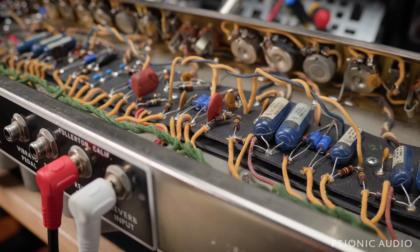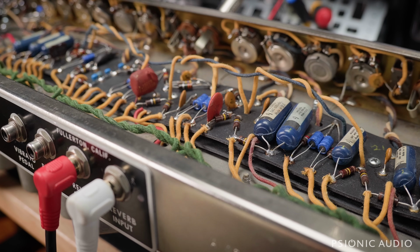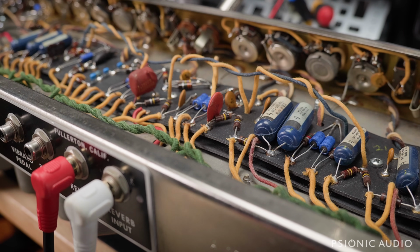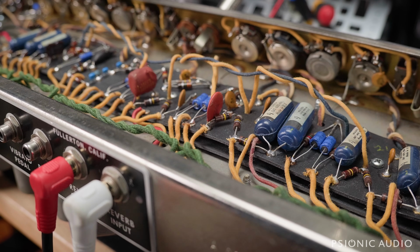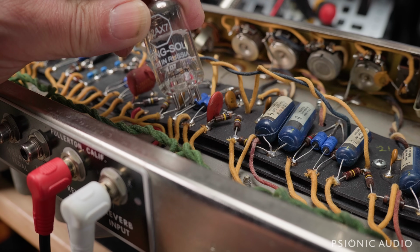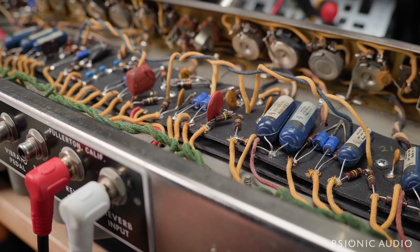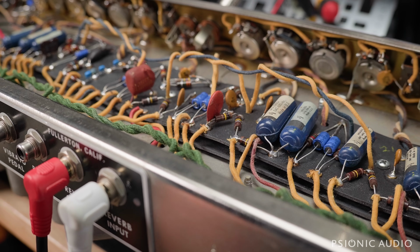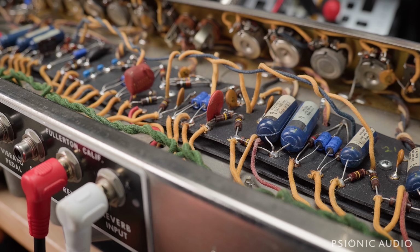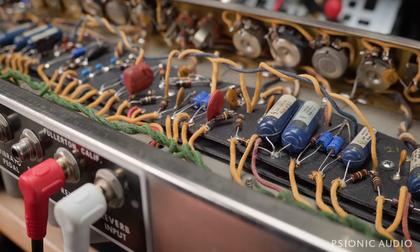You heard some little fluctuations there. And last time you guys heard this amp, it had no low end on this channel. Now, all is completely well, and there was nothing wrong in the circuit. The problem was V2. It was a Tung-Sol. For whatever reason, a lot of the Tung-Sols, in my experience, and the Electro-Harmonix 12AX7s and the Sovtek, which are all made in the same factory, they have weird cathodes. Sometimes you get really weird heater issues onto the cathode on those. And sometimes you get channel leakage where V1 and V2 are blended together, even though the volumes are off. And in this case, we were having internal leakage from V2A to V2B, which is the same signal pretty much, but inverted. And so that bleed was nuking the low end.